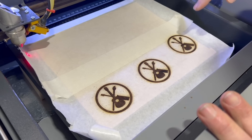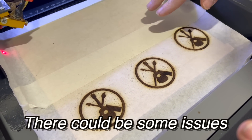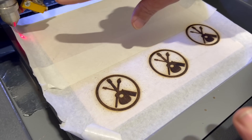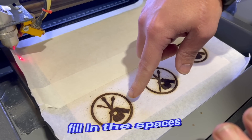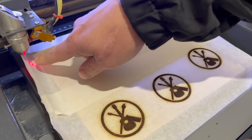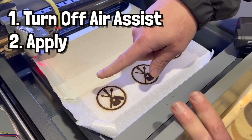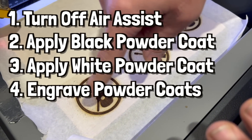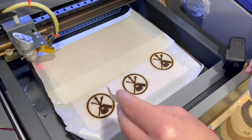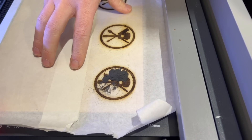Quick change of plan — the first one I put up a little too high and it went to the overlap of the tape. I moved it a bit. These two we're going to use the laser to heat up the powder coat and fill in the engraved spaces. Very important: don't move this at all so the laser goes back overhead. We also need the air assist off, otherwise it'll blow the powder coat away. So I'm turning air assist off and spreading the black and white powder coat using a stainless steel card to spread it evenly.